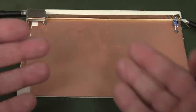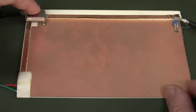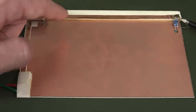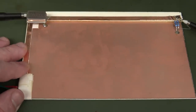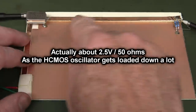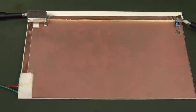We've got a basic circuit you can imagine as a product PCB: power input going along power traces to a digital chip, driving an output load — in this case a 50 ohm transmission line and 50 ohm load. We need that to get decent pulse currents — 5 volts on 50 ohms — so we can get large current transitions in the signal trace and, more importantly, flowing through the ground plane, so we can actually see the effect of bypass capacitors.